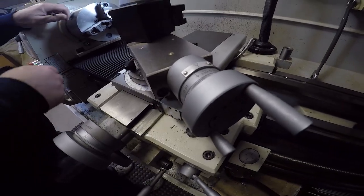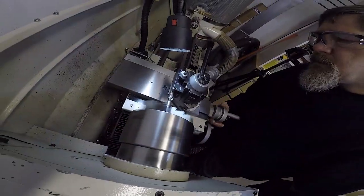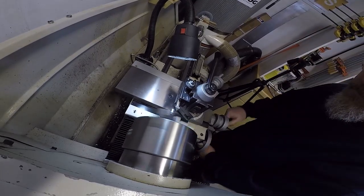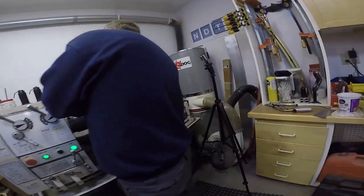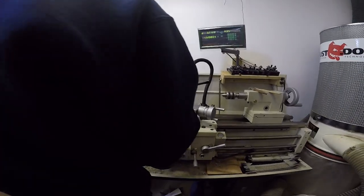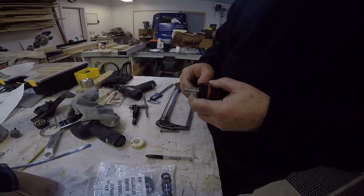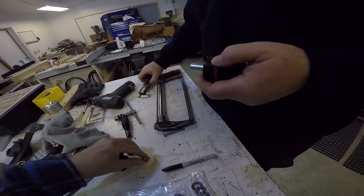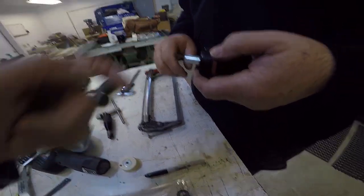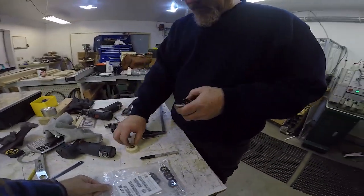So I can put it in the chuck. So that should be, that ends good. Polish it up a little bit. I think that would probably suffice. You need to make a relief cut or anything on that? I don't think so. I'll just cut it so that there's probably quarter inch maybe. I was thinking maybe if you did a relief cut, you could butt this right up against there. But I don't know. Well, that's what the washer is for, I was going to do with the washer. Okay, I see. So it'll bump right up on there? Yep. Oh, perfect. I can always take more off.